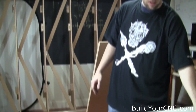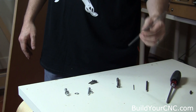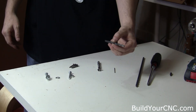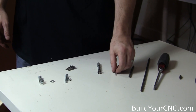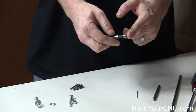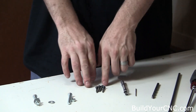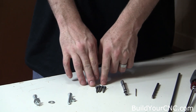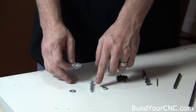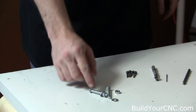You're going to need a drill, a Phillips head screwdriver bit, a Phillips head screwdriver, and a long quarter-inch drill bit. You'll see why it needs to be long once you get behind the machine — the splines make it where you have to have a long bit. You'll also need a short quarter-inch bit, a sixteenth-inch bit, and a Forstner bit, which is half inch. It makes a flat finish on the bottom, unlike a countersink which is curved. Then you'll need a couple of one-inch deck screws or drywall screws to hold the board in place while you mark the holes. Finally, you're going to need 14 sets of quarter-inch nuts, quarter-inch washers, and two-inch quarter-inch bolts.